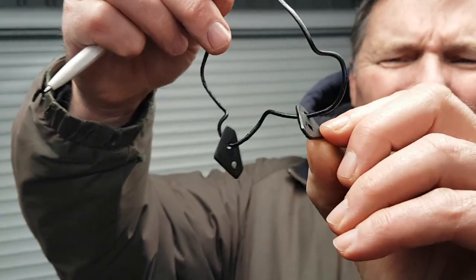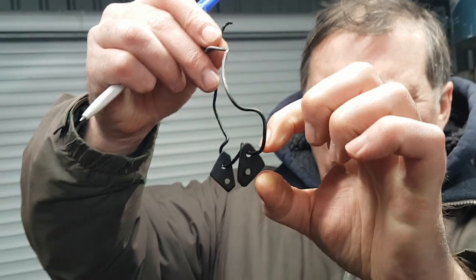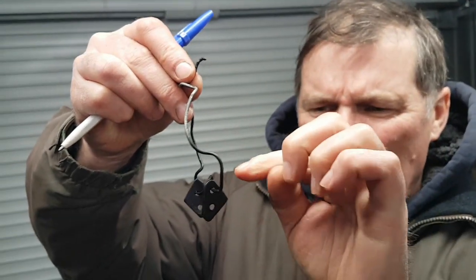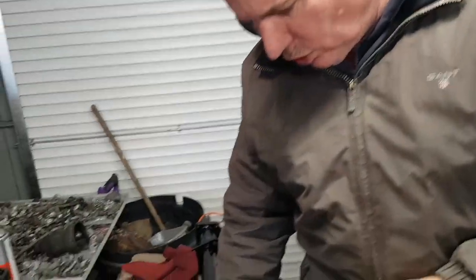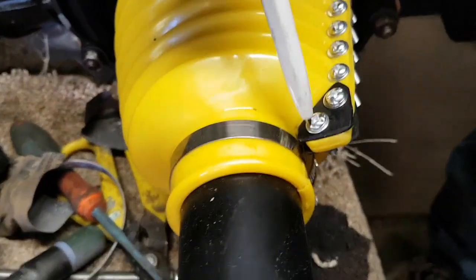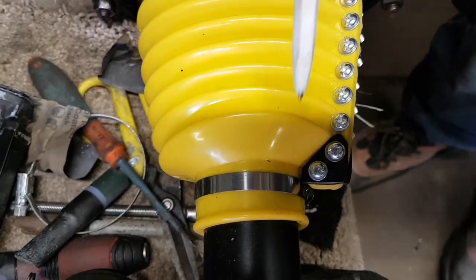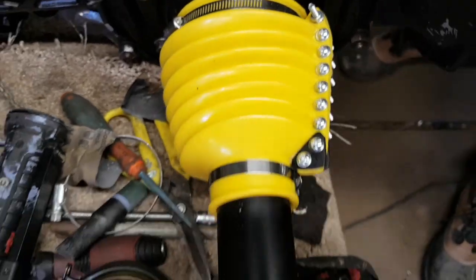Here — as you can see, I've made these little things. These are a 2.5mm plate. I drilled two holes 12mm apart and they're 4mm holes. And that will go on the other side just like this, so I can put pressure in the corner — that's what I want — and even pressure along here. I found in the past that's where it leaked from. So that's a good remedy.